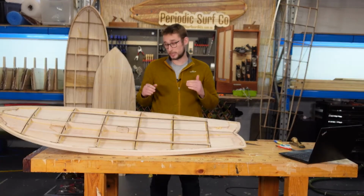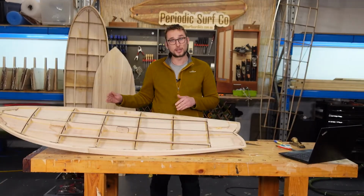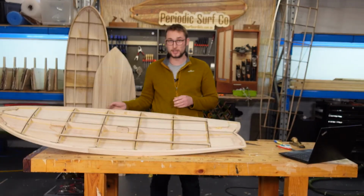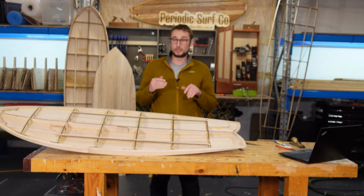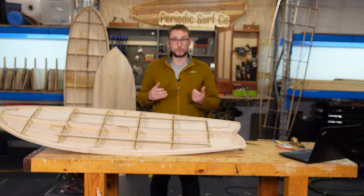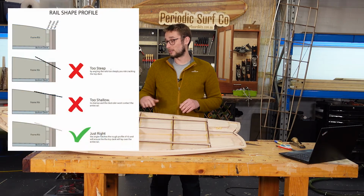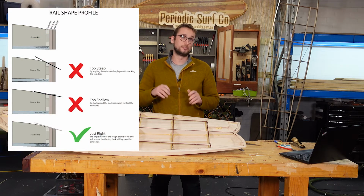Now, the angle in which we shape these rails has to be not so steep that the deck may crack by trying to bend over too tight of a radius, but also not too shallow that we leave a gap between the rib and the rails, leaving us with no glue contact. Now, we've got a diagram in the description below which will outline the Goldilocks or the perfect angle that we need.